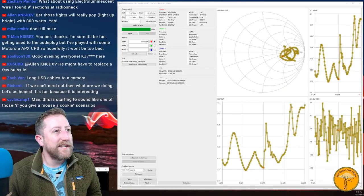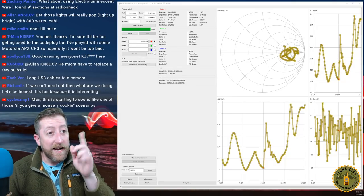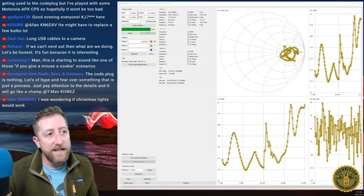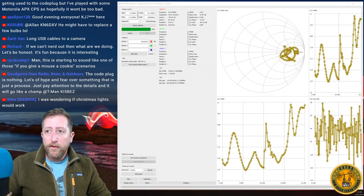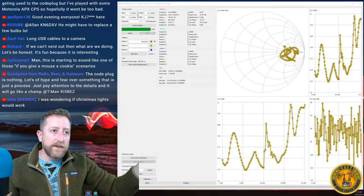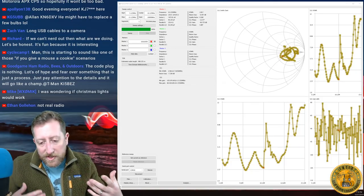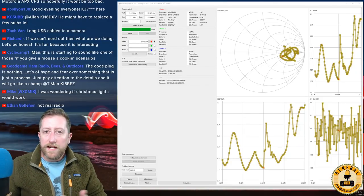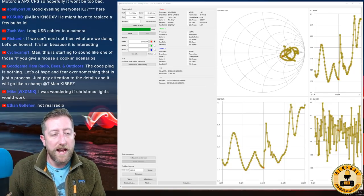All right, so what I did was I threw it on the NanoVNA. And so I cut the antenna. Remember, I cut the antenna for 30 meters. But you've got all those resistors. They're light bulbs, but they're resistors in line and serial. So measuring them out using the standard amateur radio calculations probably are not going to work very well. And we could see that here, kind of.